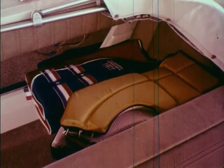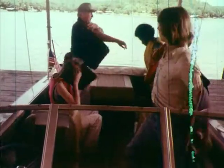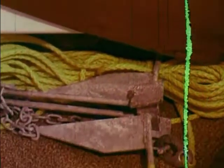Other things to locate before starting out are the personal flotation devices, called PFDs. There must be a wearable PFD for each person aboard a boat 16 feet or longer. In addition, there must be at least one throwable device such as a cushion. It is a good idea to wear a PFD at all times — in an emergency, there often isn't time to put one on. Locate the fire extinguisher and know how to use it. Make sure there is a throw line such as a ski tow rope, a first aid kit. These should be on every boat along with a paddle and an anchor.